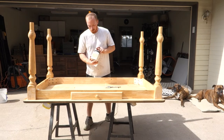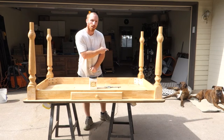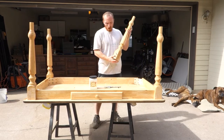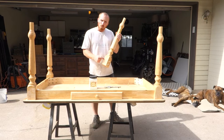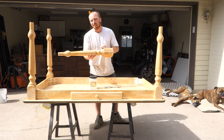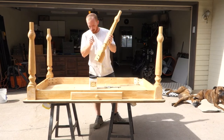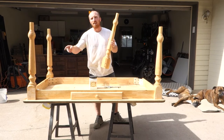Alright, we've got the top completed. Now what we're going to use is our Dixie Belle Drop Cloth White to get the rest of this painted. I have two supervisors over here working really hard, so I guess it'll just be me painting today. What I'm going to do is actually remove all the legs and paint inside here — it gives it a nicer, clean look. If somebody buys it and removes the legs, it looks clean. And if somebody ever moves, they take the legs off and it's all painted — they don't have to worry about trying to match it up perfect when they put it back together. I'll show you a little trick on how we paint these legs nice and quick. Let's get all these legs off, paint the frame, get the door taken care of, and then start painting the legs.